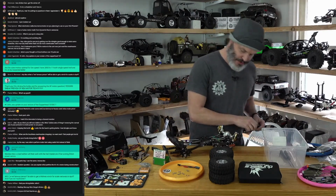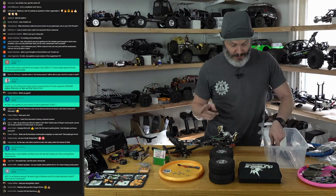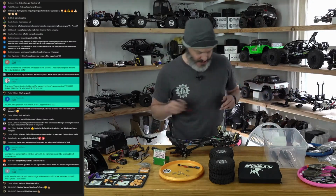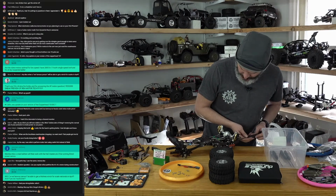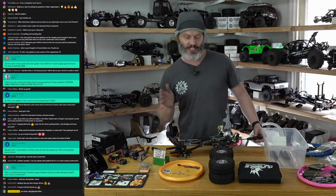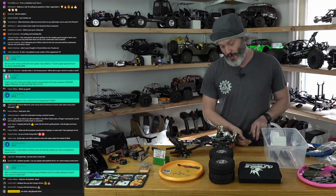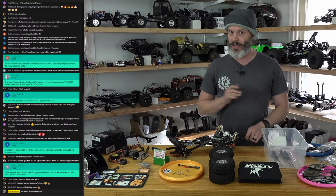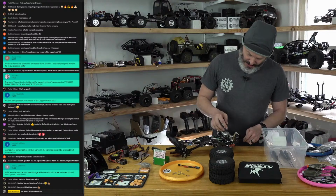But also when you do it that way, you have the no-load losses of the motor. So the true way to test kV of a motor is that you would spin it up on 10 volts. You would see this RPM, but you would also see your no-load amp draw. Then you would use a secondary motor to increase the motor RPM until you had 0 amps of draw on your test motor. Now that's going to push amps onto your slave motor in a sense,